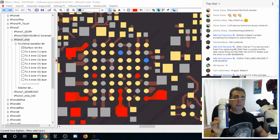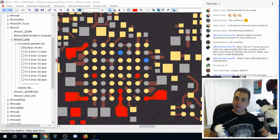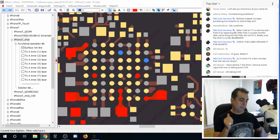What I don't know is whether or not the moisture inside this thing will be a problem on your logic board. I haven't had it be one, so I think it's relatively safe, but I can't say that for certain. But I would probably start by freezing whatever part of the board you can see under the microscope, turn on the power supply, and see what melts first. Now, a lot of times that's going to be misleading, again, especially with a low amperage draw like that. So, yeah, that's going to be a tricky one.